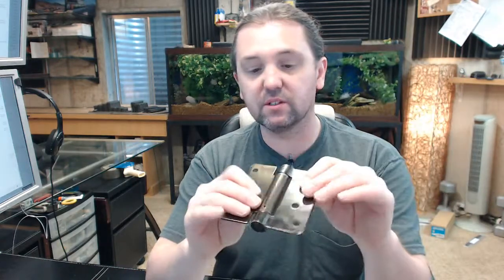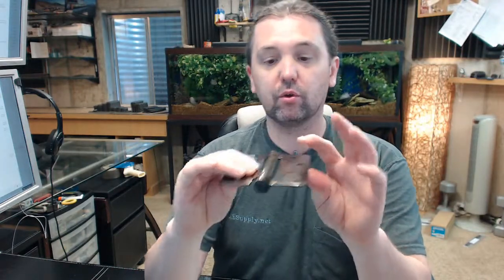More hinges also reduces the amount of work on any one hinge. If you set the tension so high you can hear a creaking in the spring, that's the spring actually beginning to contort — you don't want that. Per the guidelines: a 45-pound door calls for one spring hinge, a 75-pound door calls for two spring hinges, and a 90-pound door calls for all spring hinges. That makes sense because these are residential-thickness hinges.